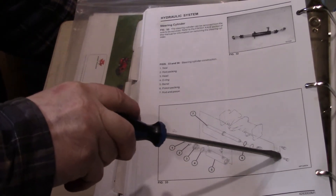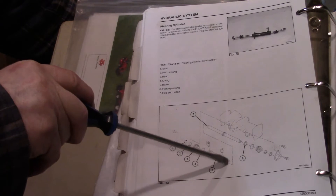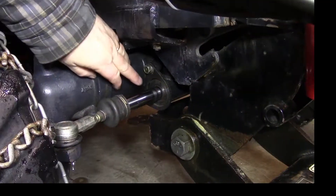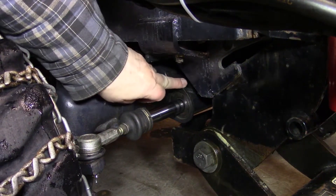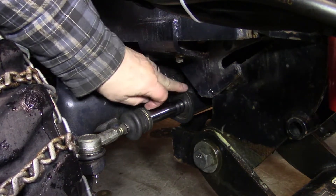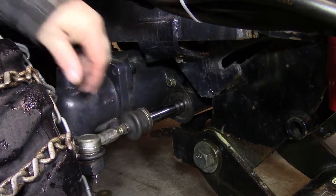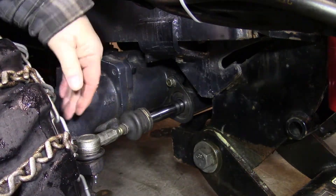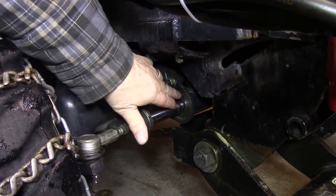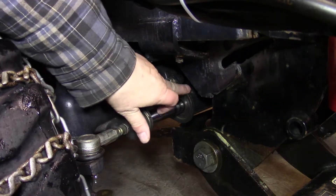What I'm thinking is the holes inside these flanges are getting worn out and the body of the piston is now slopping around inside them. Let's go look at the tractor. There's the cylinder right there and there's the flange — two bolts hold it on. It connects through a universal joint to the tie rod, which is connected to the steering knuckle and wheel. It pushes and pulls to steer. I'm going to start the tractor and cycle it back and forth so you can see how much that cylinder body moves inside this flange.